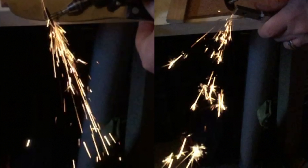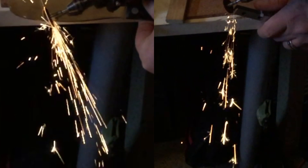Here's a still frame: tool steel on the left, rail number two on the right. Now looking at hardened stainless versus the MG12 rail — on the left is the hardened stainless, on the right is the MG12. You can see how much more energetic the little bursts are on the rail than on the stainless steel, which leads me to believe this is probably not stainless. This is probably a hardened high carbon steel, so I think that's fairly conclusive.